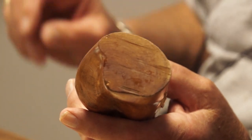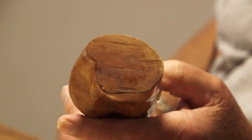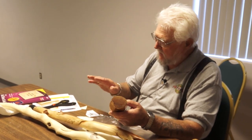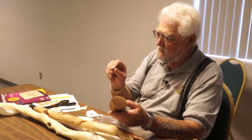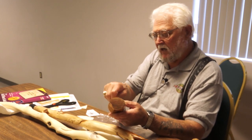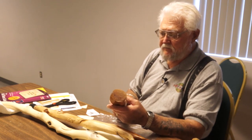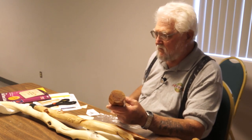Where it's real thin like that, some of the tools I made — like those jeweler screwdrivers — I take and round off one side and leave the top side flat. It's really good to get into real small places. Just take your knife and make your stop cuts on each side and peel it out with that tool — it works real good. I make a lot of my tools if I can.